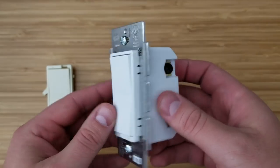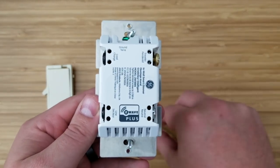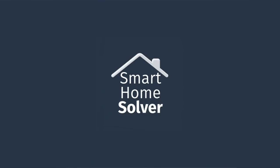Another thing with smart light switches: if you have multiple light switches controlling the same light, you'll need a three-way light switch, and the one we're using is compatible with three-way light switches. If you get a dimmable smart light switch, make sure your lights are dimmable as well. And some people are going to say forget it, I'm just going to swap out my light bulbs for smart light bulbs because it'll be easy — which is totally fine. Hopefully you found this video helpful. Subscribe to the channel if you want to see more smart home videos, and we'll see you again next time.